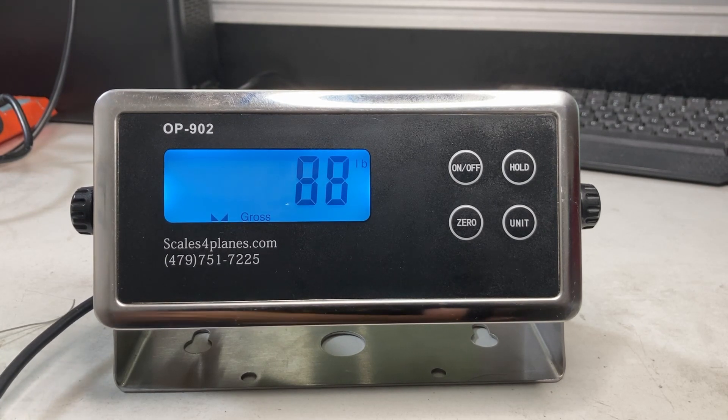If it's just a home run cable on a floor scale, it can easily be changed out. But on a vet scale, it's not so easy — you have to resolder or get a whole new scale. That's the best way to fix an indicator that does not change from zero.